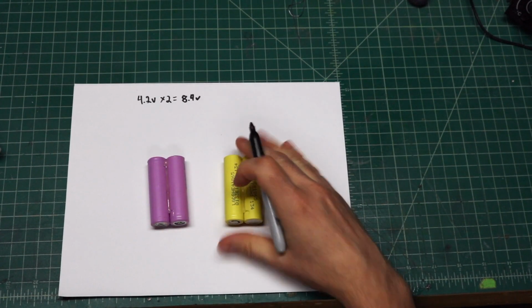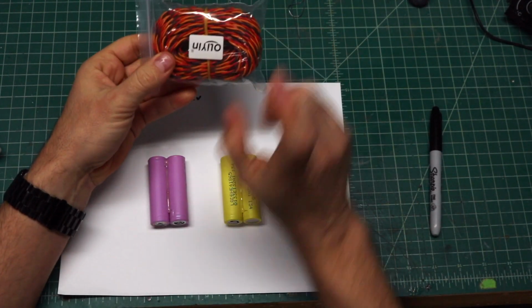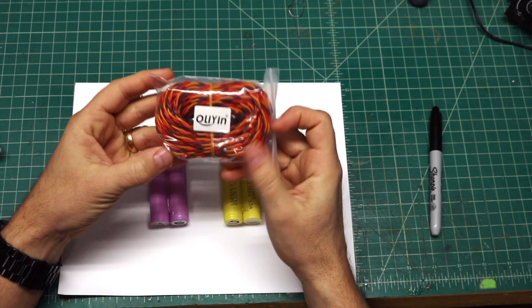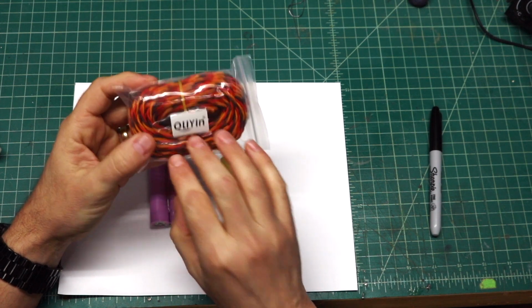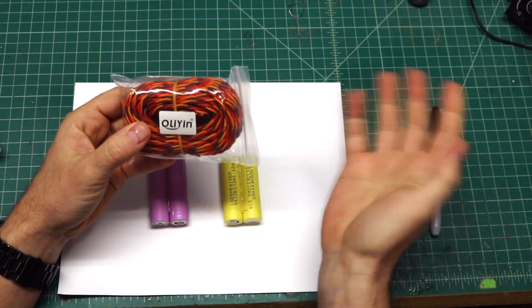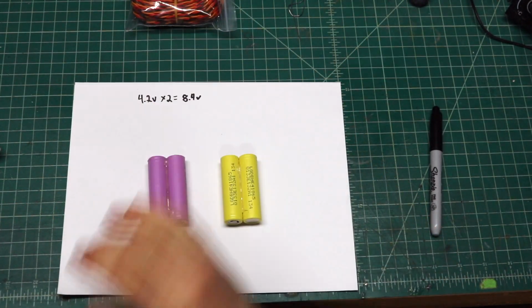Now I'm going to show you how we're going to wire this up because they're going to be plugged into receivers. I have here receiver wire. I'll leave the link in the description, but it's 32 feet, 22 gauge, which is more than enough for the voltage and the amperage that's going to be pulled for the receiver and the servos and so on. So not an issue there.